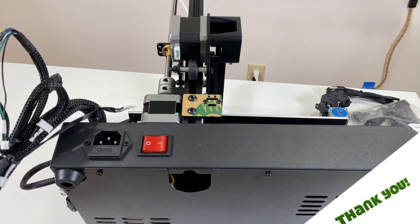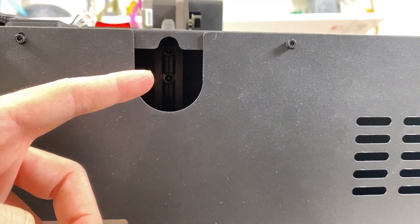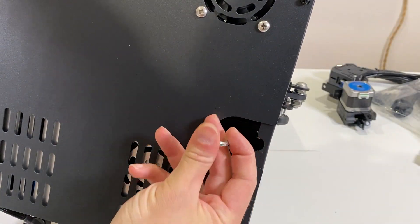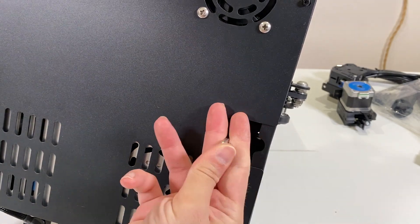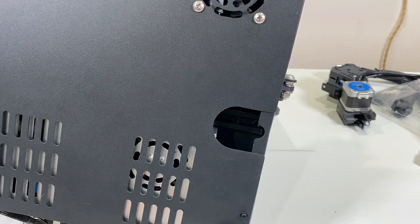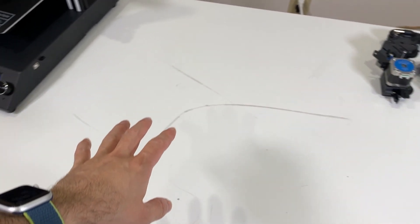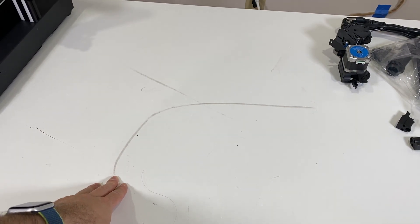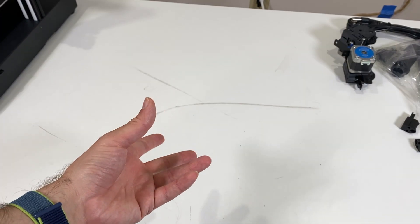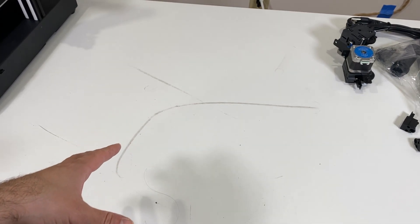Next is the other side. Let me show you how it looks from the inside — there are two holes in there and I put the screws into those holes. I reoriented the printer and I'm going to do the exact same thing for the opposite side. Also, one thing to note: when you are moving the printer around it is leaving a residue on your white table. The rubber legs leave residue if you just slide it without lifting — be careful.